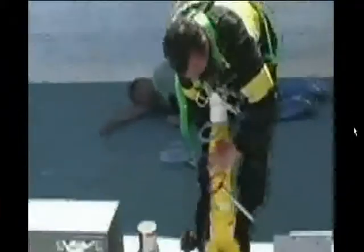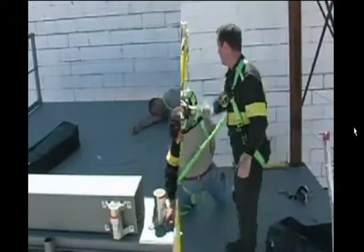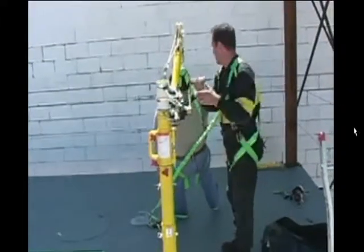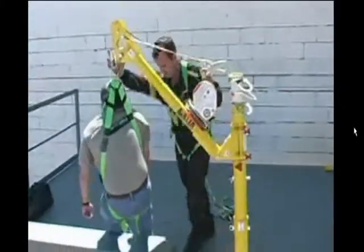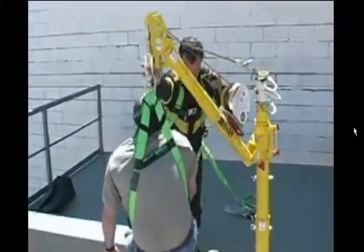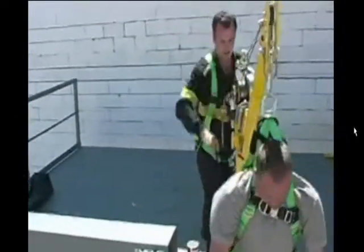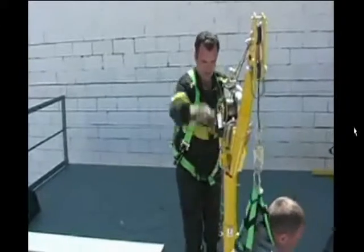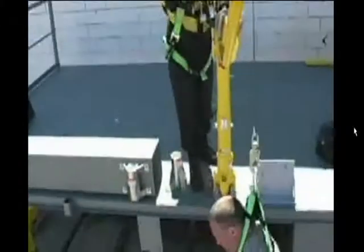The rescue davit can be used for a wide variety of tasks. For instance, it can be used for a confined space entry on top of a working platform. The davit allows the ability of a work positioning winch to be utilized. By strategically placing the weld-on plate on the edge of a working surface, the portable fall arrest anchor post and rescue davit is an ideal tool for lowering an injured worker from the working platform.